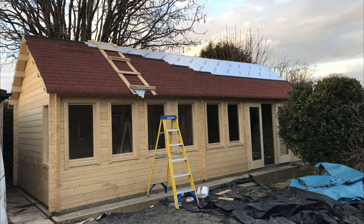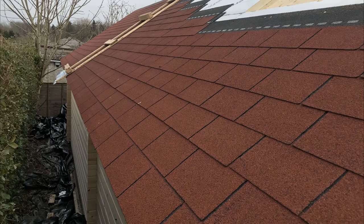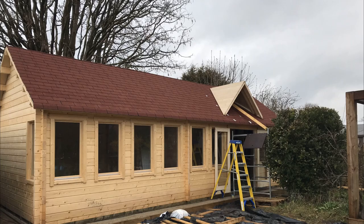That proved a bit of a problem because the roof is quite steep — there was no real way to stand on it like in the supplier's instructional videos. So I had to make a crawl board out of the leftover empty pallets so I could hang on and apply the shingles. It was a super slow process — maybe a row of three done, then go down the crawl board onto the steps, move the steps over, move the crawl board over, grab more shingles, and repeat. It took quite a while to do the front and back of this ginormous roof. The reason I made the crawl board was that I'd actually fallen off the roof a couple of times — luckily starting at the back, the hedge caught my fall. Safety is important!